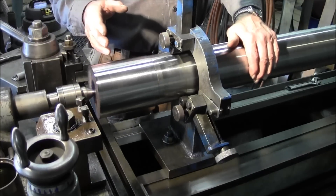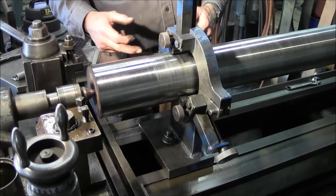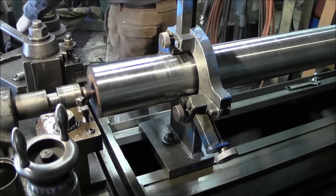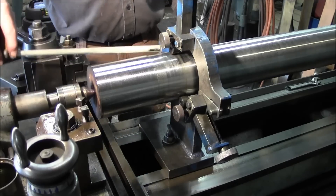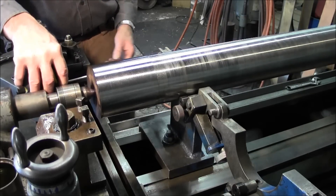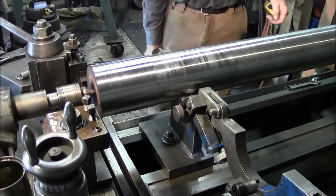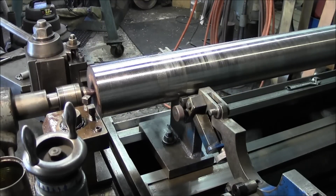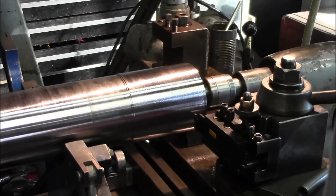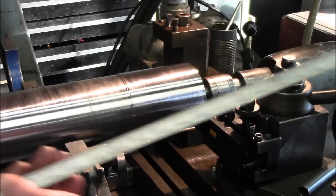We may have to lift this one more time because we're going to put our tape measure in here and we need to get the overall length from end to end. We stretched that out - it was 37 and 5/8 overall length. We're probably about 30 thousandths over 37 and 5/8 right now. There might be a little curve in the blade - but actually let's give ourselves a full 16th of an inch - 60 thousandths.